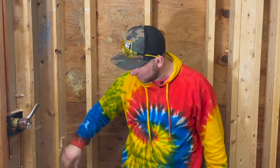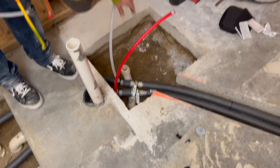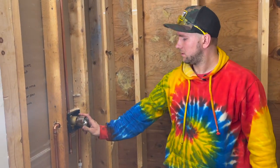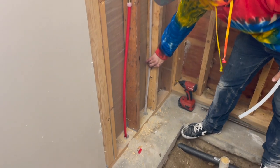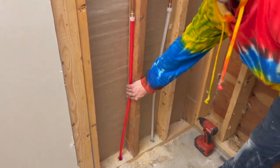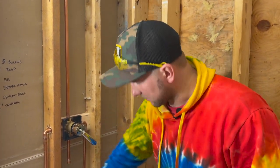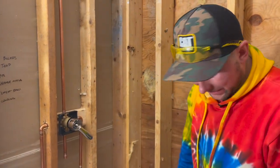The pressure is on. You can see the water in these pipes already. I'm going to turn this off and then we can start working. Tomorrow I'm going to nail these pipes down over here to make sure they're not kicking. Sometimes you hear banging behind the wall — that's because the pipes aren't secured. When you turn the water on and it kicks like this, that's why that happens.